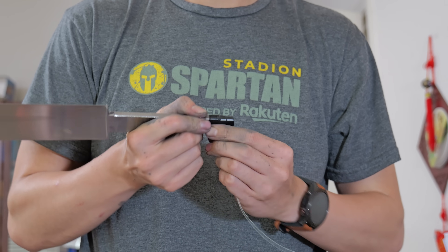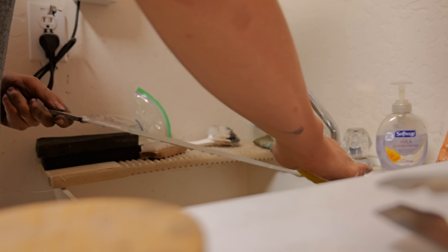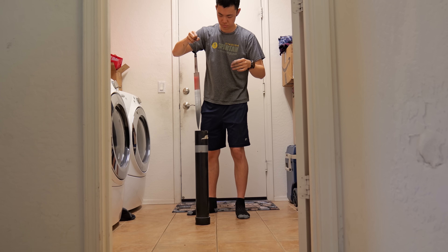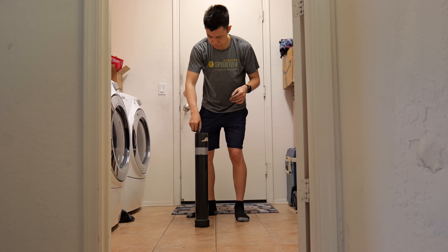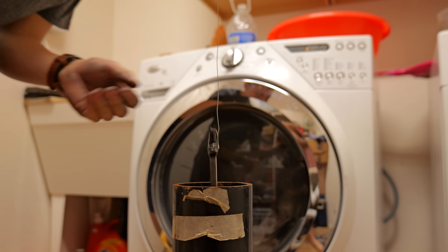The process by which I'm going to etch this blade is two dips into ferric chloride that are 1 minute and 30 seconds each. In between those two cycles, I use some 2500 grit sandpaper to sand off all the oxides. Sanding off the oxides is actually fairly important because it's what helps drive up the contrast between the two differing metals.